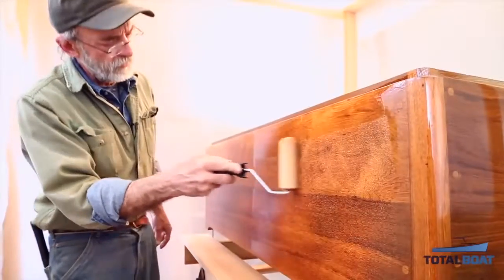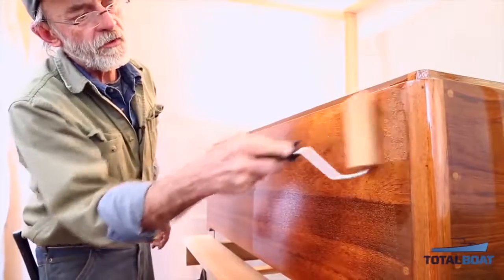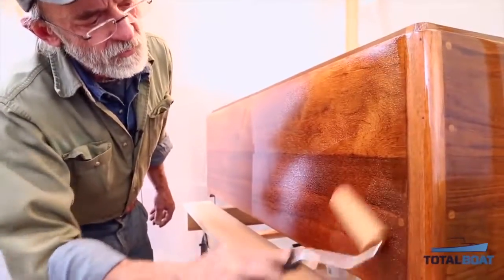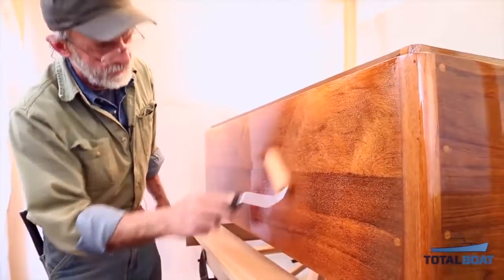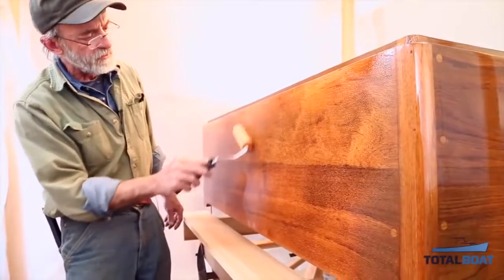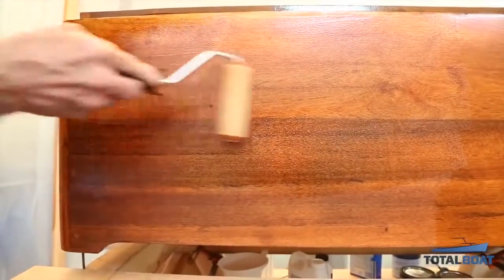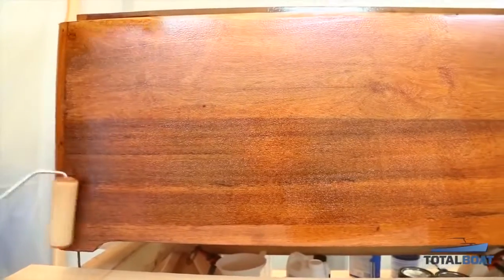So this varnish is rolling on so well that on the front of the box I only rolled a third of the box, but on this back of the box here I've just rolled out half the length of the box with one roller full, just like that. Now that would be pretty tricky to distribute as evenly as that with a brush. Quite a bit of varnish squeezed out of the roller up here, so I'll just go pick that back up again and move it down.